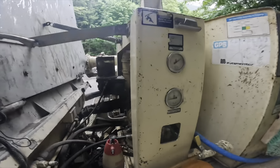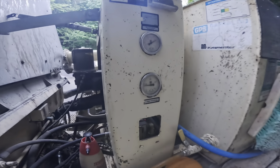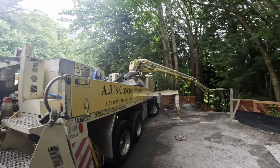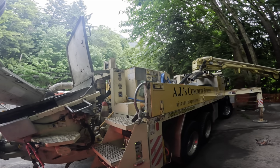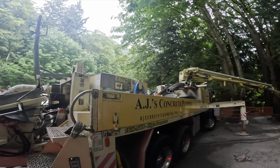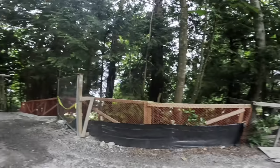This thing's not even working. Pressures are way down. I should mention on this thing, 200 bar is the equivalent to about 300 bar when it's plumbed over to rod side. This one is at piston side, so we tune the relief valve down to limit it to 200 bar, which equates to 85 bar line pressure for the boom pipe, which is what it's rated for. And when we plug into a high rise right off the back end, we'll tweak that back up to 300 bar for full maximum performance. It's hardly even registering on the temperature gauge.